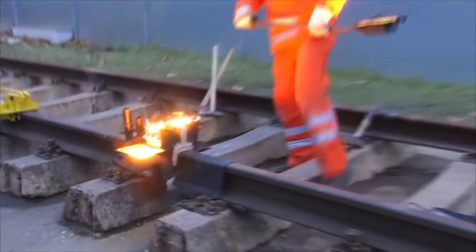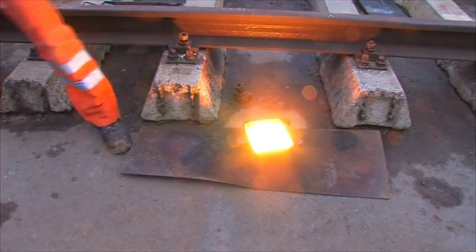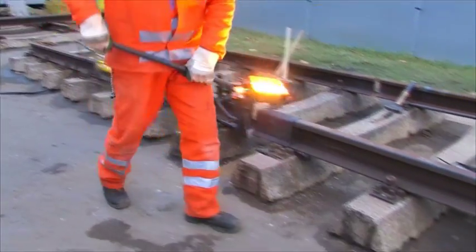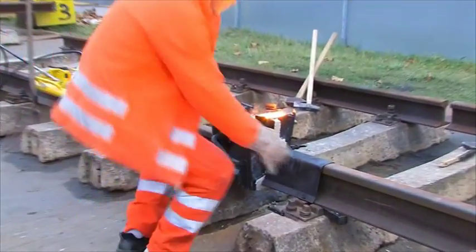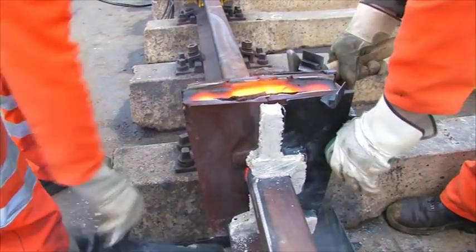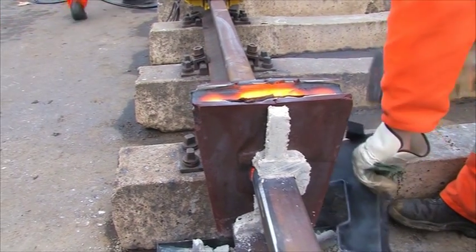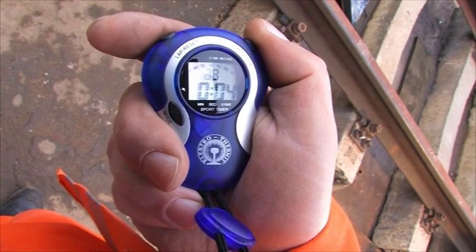The empty crucible and the slag pans are to be removed and placed on dry and non-flammable ground. Attention! If hot slag contacts moisture, then oxyhydrogen gas explosively generates. Danger of accident. The protection of the rail heads is taken off. Now the clamping device and then the mould shoes are to be removed carefully. A specified waiting time after pouring should be kept for this.